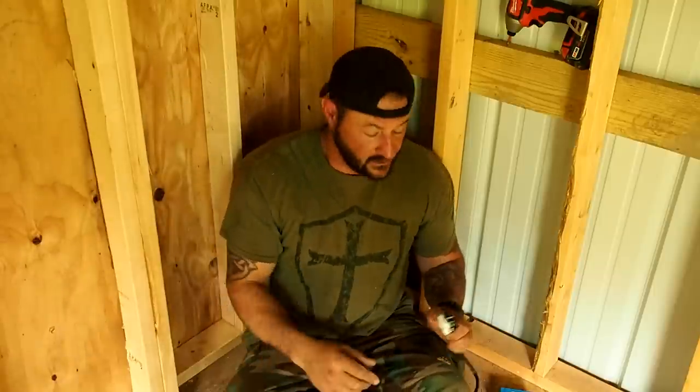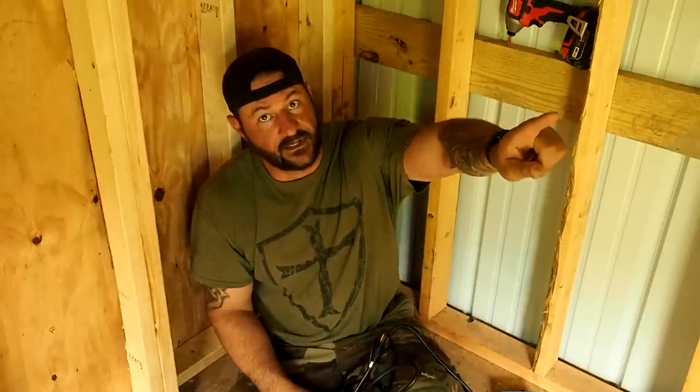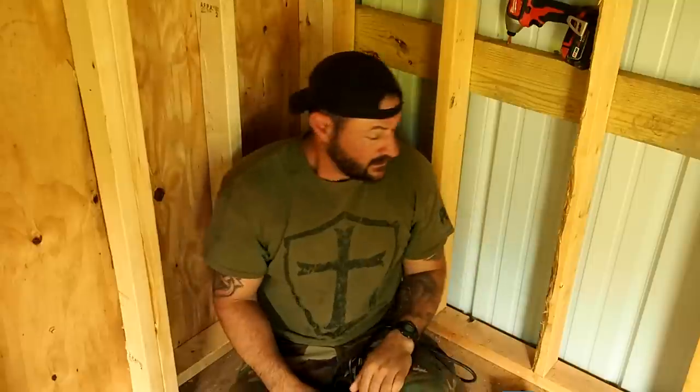From there, we're gonna splice in and go to the opposite wall from me, exact same spot, but directly over here, and put another outlet. So the pigtail can be plugged into a gas generator, diesel generator, or in my case, a solar power generator, giving me power into my outlet, into my light, and into that outlet. Down the road, we'll come back and splice into this light, to another light over here, and then down to an additional outlet. But my point is, this is very simple.